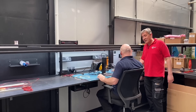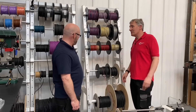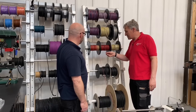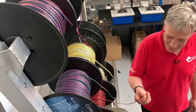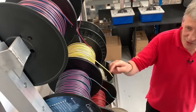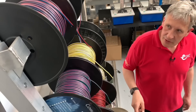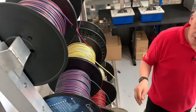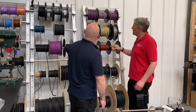Leon has brought us over to a fine selection of cables. This is the standard cable used on most projects. For a single color we've just done a two-core - we call it a shotgun cable because it's got two barrels. It's used in the audio industry. For multi-strand there's more like a type of ribbon cable - three, four, and five core - for tunable white, your two-color types of LED, color temperatures, and RGB.